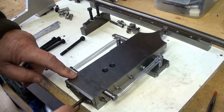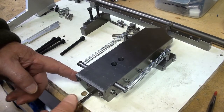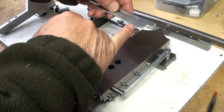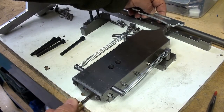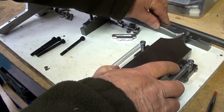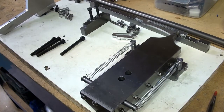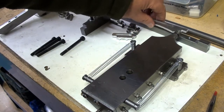I've also made this screwer here, which bears on the end of the base. So if we start off cutting — this for example — screw it out until the roller just touches the end, then screw it in so that it will take a little cut. As the carriage travels down it will ride that crest and cut on a suitably sized piece of stock. That shape, gradually winding this slide in, will take progressively deeper and deeper cuts.